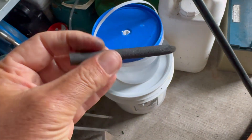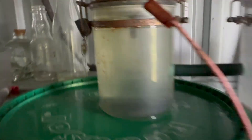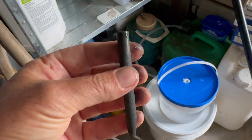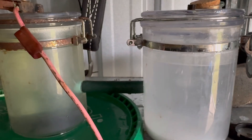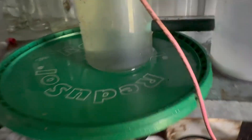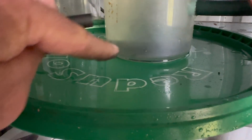Here's a carbon electrode I've used in the past. This one was used on the anode side — you can see it's very corroded at the end, but not as corroded as this one which has been worn down to a knob and broken. Carbon is perfect for electrolysis of seawater and for producing sodium hydroxide, because the contamination that occurs when these rods break down in the seawater, sodium hydroxide, and chlorine side is far less toxic — not toxic at all.